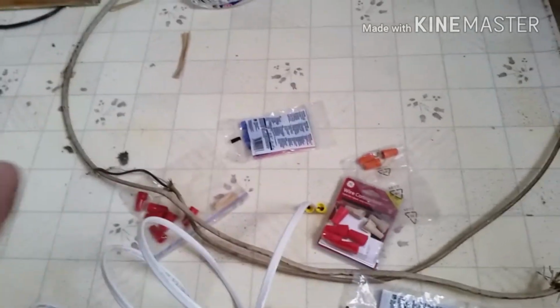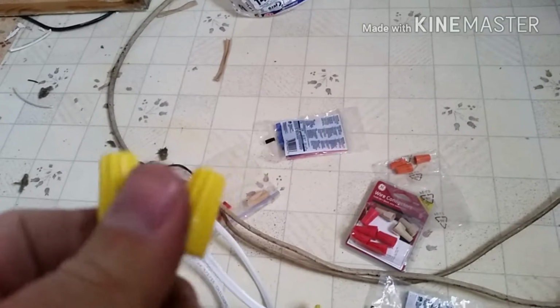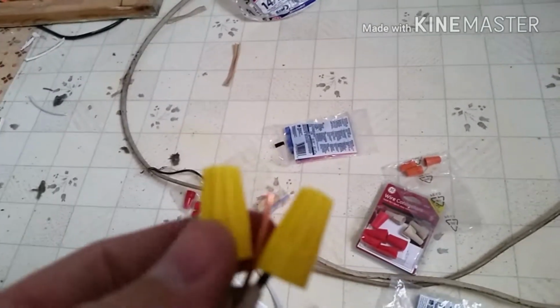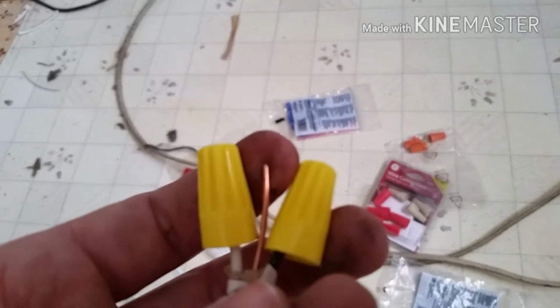So, before I go up and reconnect this line back into the box that I just connected that other one from, I wanted to show you that since I'm not currently, I'm going to have to get back to it another day, going to be connecting the light to it. I wanted to cap it off. You just need to cap the white and the black. The ground doesn't actually have power going through it.